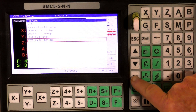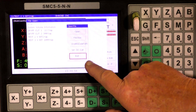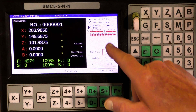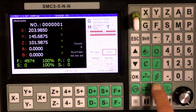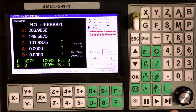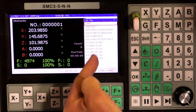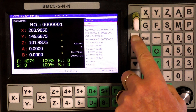You can either press OK or this button again to bring up the next little box. Then you come up to Open, press, and that puts it into the memory of the machine — or actually it reads it from the stick if the stick is still there. To check whether the code is in, press this here and there's the G-code. To escape out of that you just press Escape.